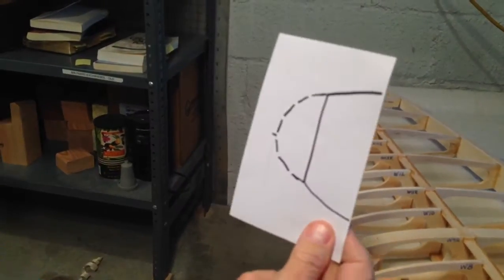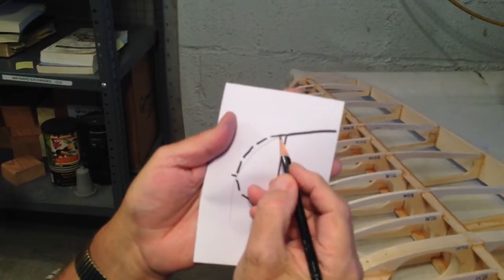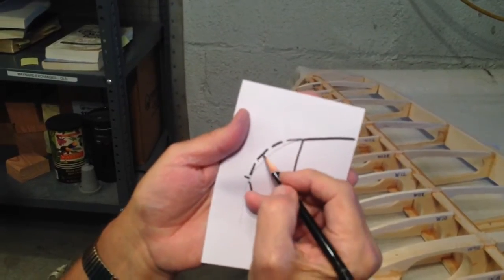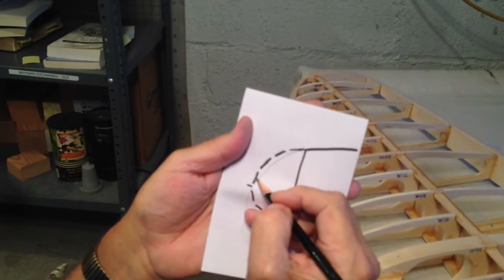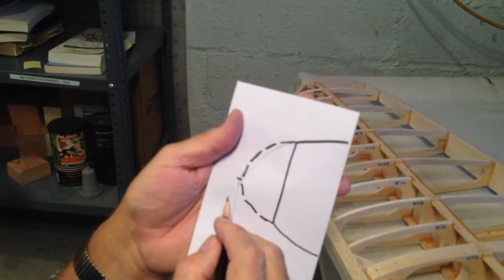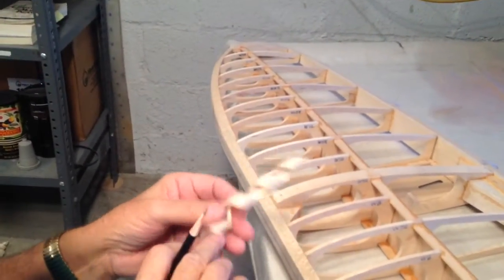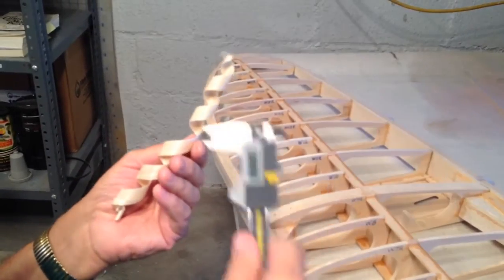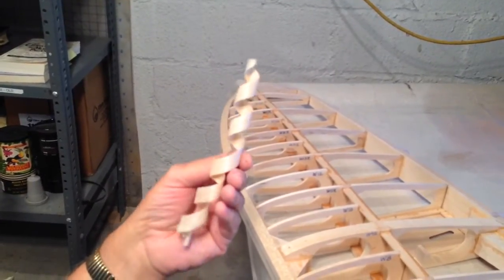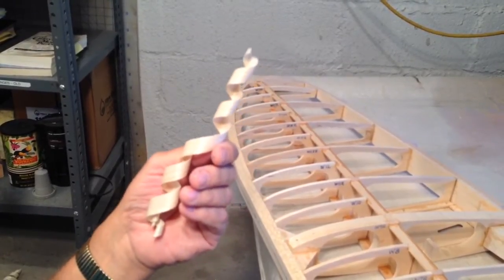In order to do that, we're going to carefully — here's where we're going to wind up — but we just want to come out here. This is the flat we already have. So we're going to do a little bit here, a little bit here, and a little bit here, but not so much that we take out that blue line that is inscribed on the leading edge. In the last video I measured it with my calipers, and this is about 20 thousandths of an inch thick.